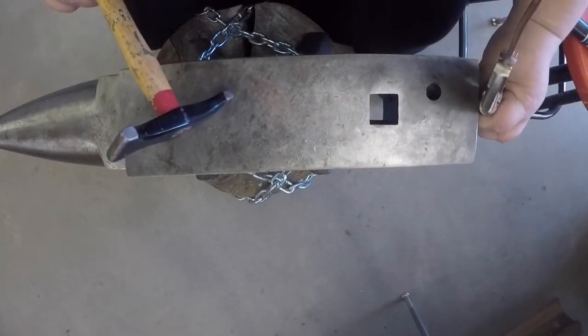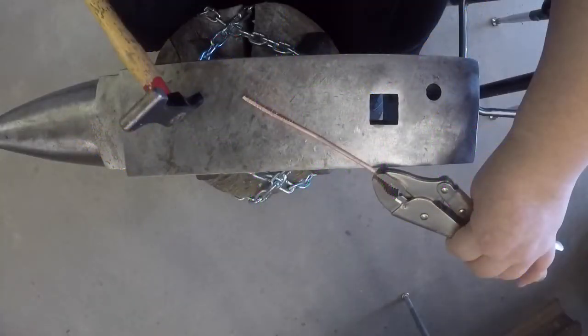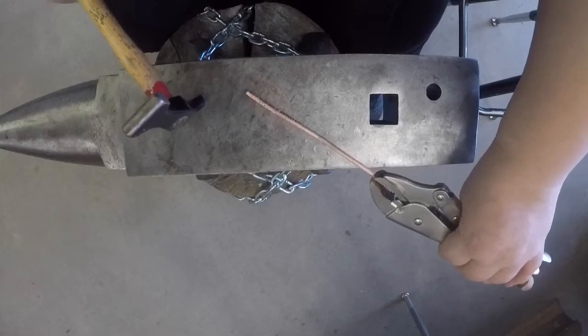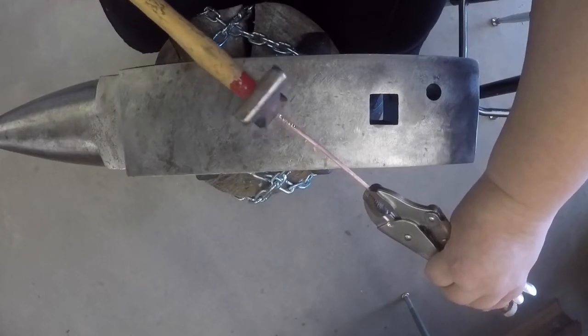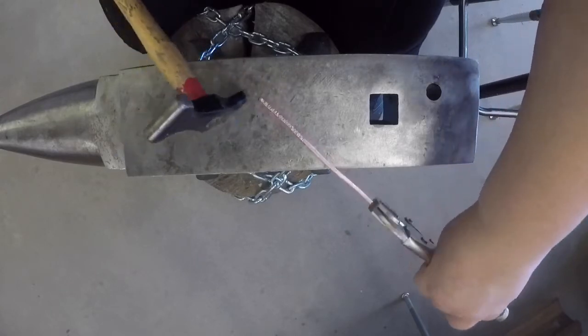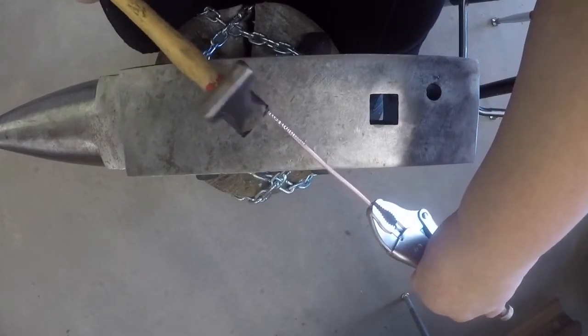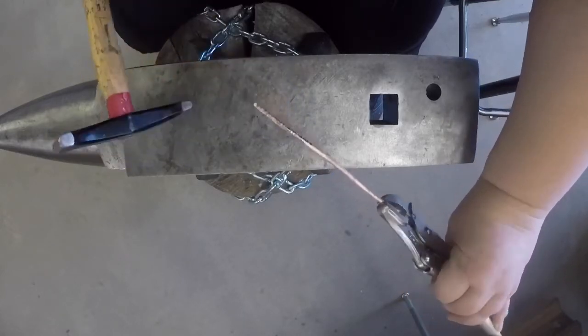It may be difficult to see here, but if you look at the end of the wire, the cross section is not exactly square anymore. Fear not, all is not lost. There is a way to correct it. All you need to do is hammer all 4 edges of the square to make an octagon, and then make it square again. Once you have it square again, keep hammering and annealing with each course moving further down toward the end of the wire until you have it the shape you want it.